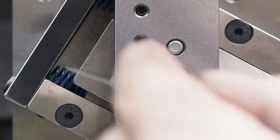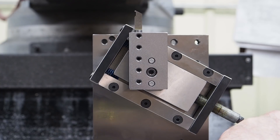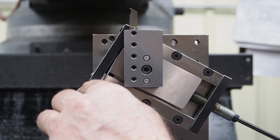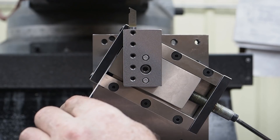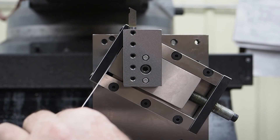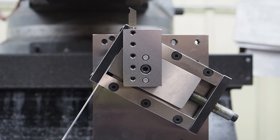This surface is ground and this surface is ground. There are heavy die springs sitting in there to keep pressure on it, and I've got high-pressure grease in here — it works really smooth. In my case I needed to put a groove about 40 thousandths deep per side at a 30-degree angle. So here I've got 40 thousandths worth of feeler gauge, I come up and tighten on that, and now I'm set. As soon as I touch the angle on the internal part I can move the feeler gauge out, wind in to bottom out, and I know I'm at an exact 40 thousandths per side.